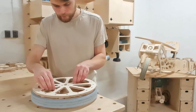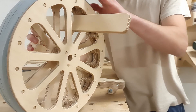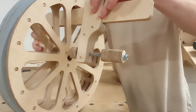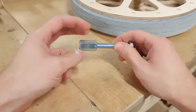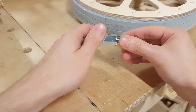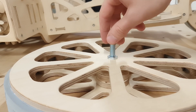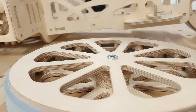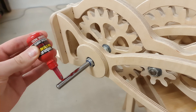After placing the other disc on top of the wheel, there seemed to be a small gap between the center piece and the wheel disc, so I clamped it together and waited a couple of hours for the glue to set. After a while, we could remove the clamps and secure the long nuts in the middle of the wheel. To ensure the thread lines up properly, I attached the long nuts to a screw before hammering them in place. Now we can glue the wheel to the gear axis using thread glue.